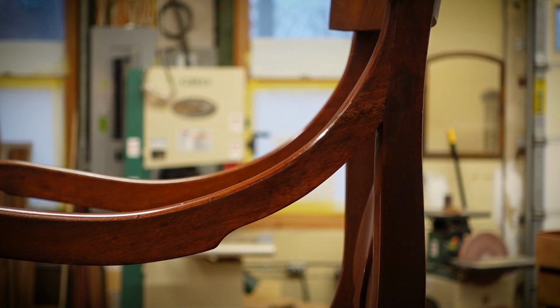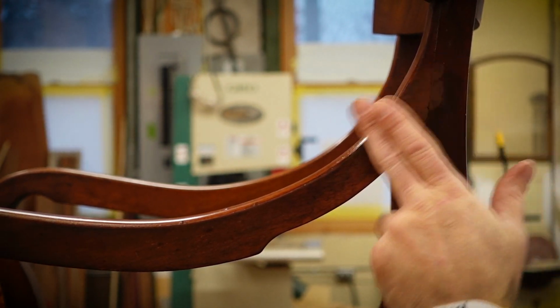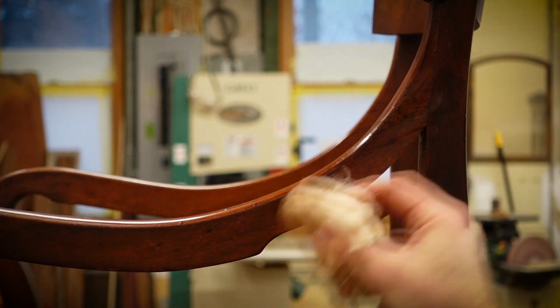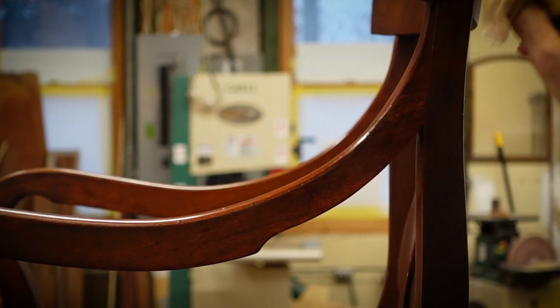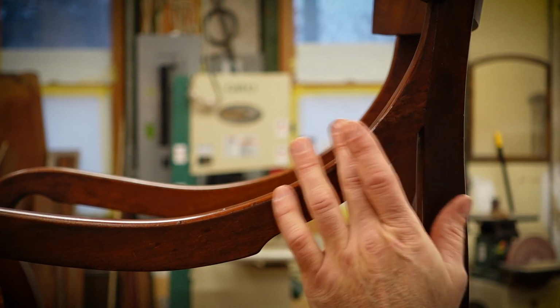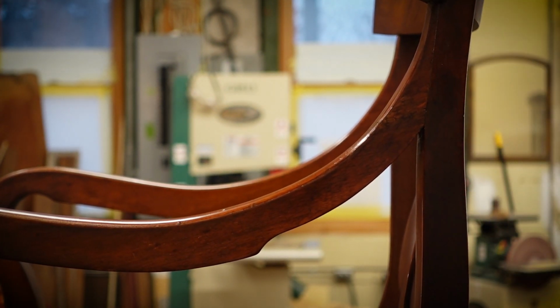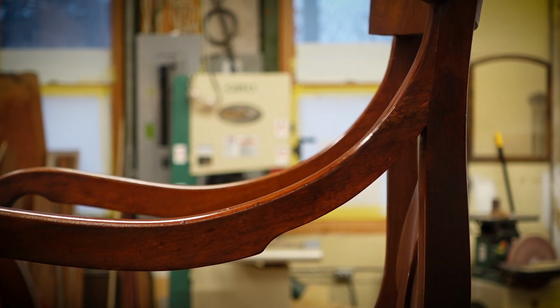The next thing that we can do here, like I said, is to simply apply some, now I'm dabbing my finger directly into my colors, and I'm going to rub the dry powder right over top of this repair, just like that. Now, right now it's just powder sitting on there, so I'm going to take my rag and gently wipe over top of it with the idea that the lacquer will pick it up and help bear it. And again, you have to be very cautious with this.